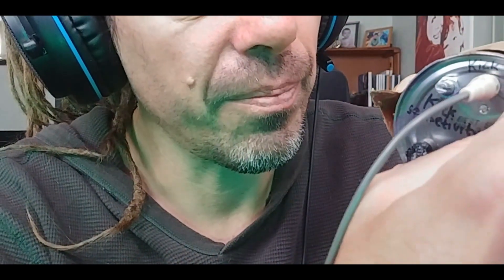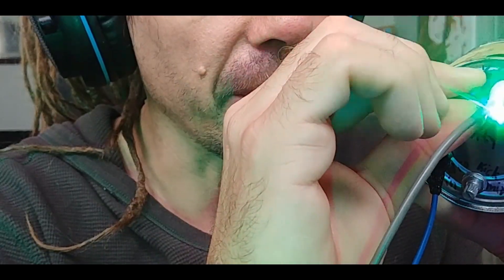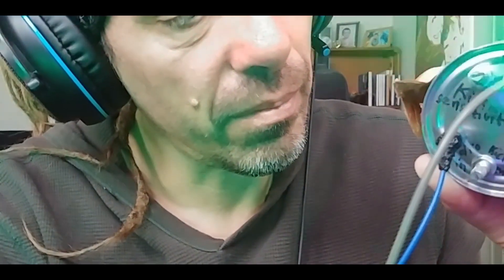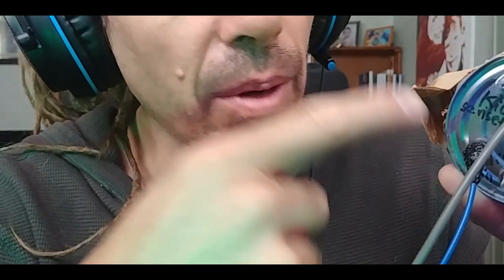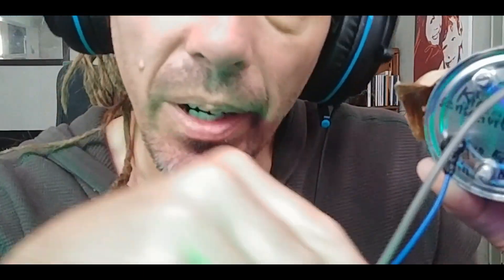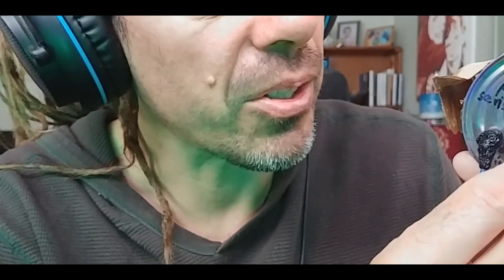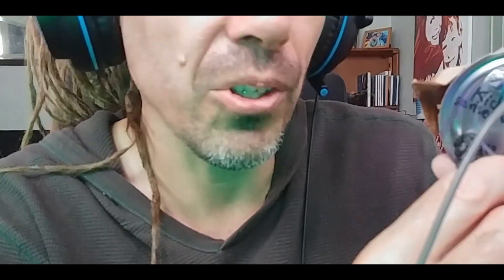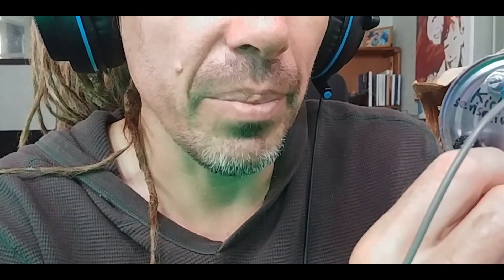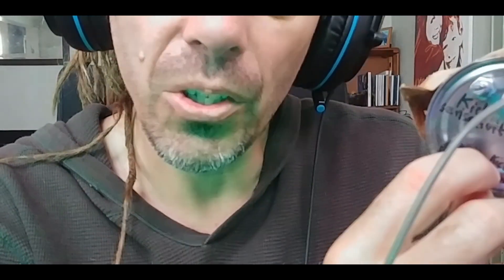Turn the decay up and get longer tails on the envelope, turn it down and in some settings it won't even trigger the envelope follower. This module also has a mixer in it to mix in the kick. If you want to have the kick routed separately into your mixer, that's fine, but you can also mix it into the audio signal. I built it so the kick has a gain of three into the audio signal path so it can clip.